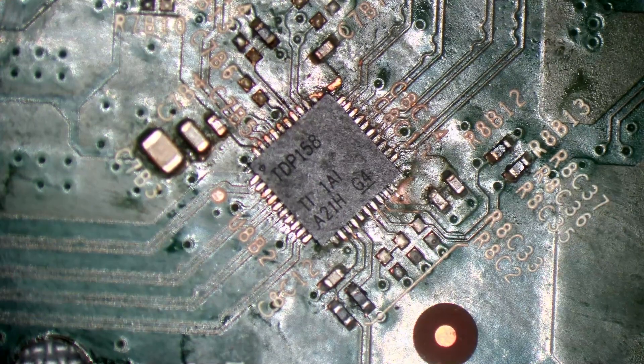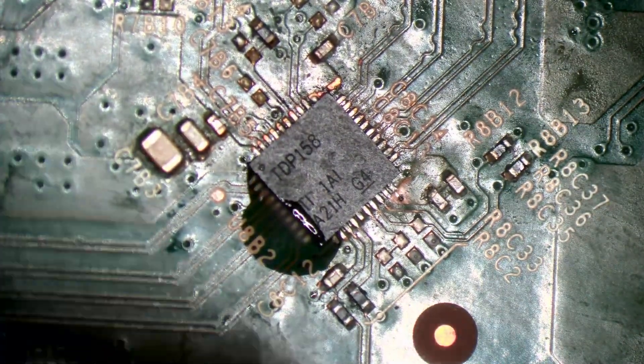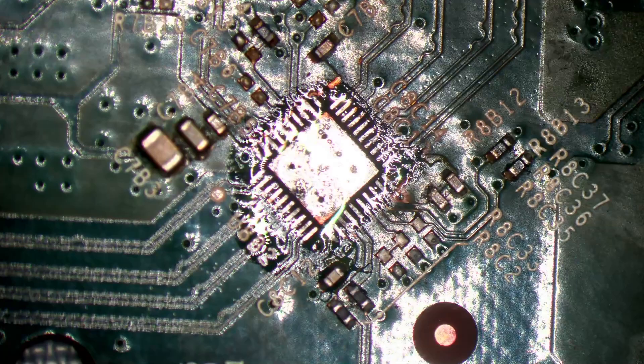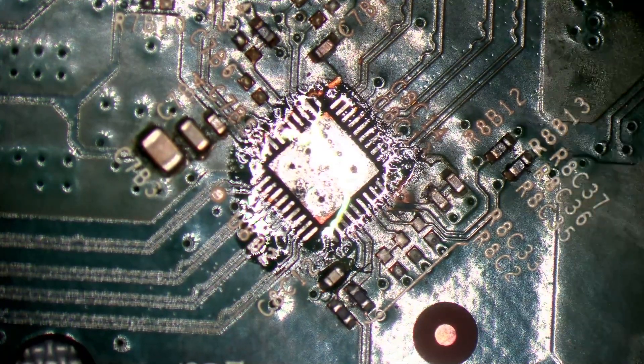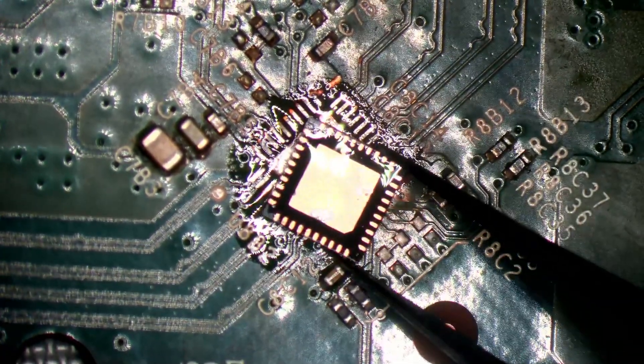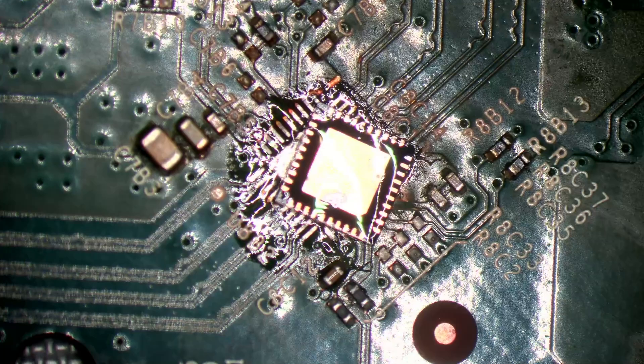The story behind this: the customer said he was given it by a friend or a family member. The person who gave it to him said, 'If you can fix it, you can have it basically for free.' So no wonder. I don't know where it's been in the past. Absolutely no solder at all on those pads — it's never going to work like that. The solder hasn't contacted it at all. Someone's literally just taken the chip off and tried to drop a new one straight on without re-tinning anything. That's probably not going to accept solder now, so I'm going to need to tin it.